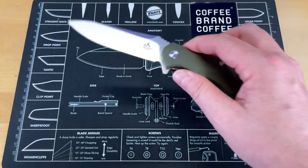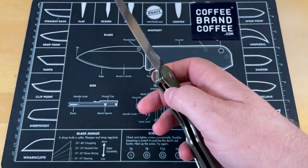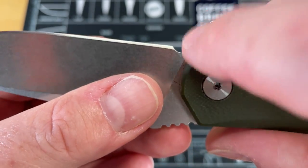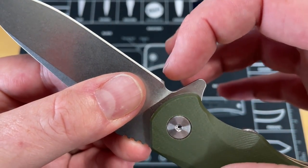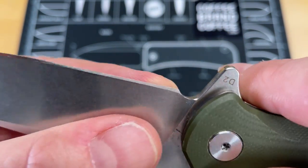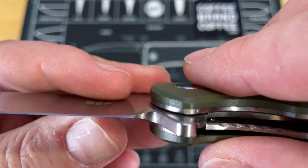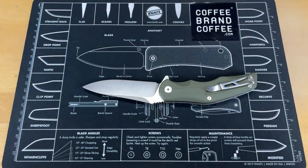Other than that, I'm not a big fan of green on knives — I don't like green G10 — but this does come in a black version so I can't really complain about that. There is one last thing: the transition. Can you see how it's a little thicker? You're definitely going to get a smile. You can see where the edge comes down — that little bit right there, I think they could have done a little better and just taken that point out slightly. Not necessarily making a full finger choil, but opening that up ever so slightly. You would have less thickening of that edge. You can see where it starts to get thick as you transition back, and so over progressive sharpenings you're going to notice that point stands up more prominent and you're not going to get into your ricasso, your plunge, anywhere near as bad on your stones. Just some minor little things.